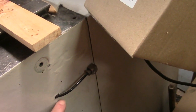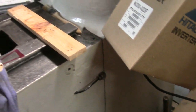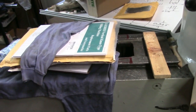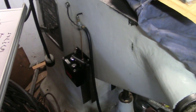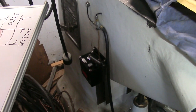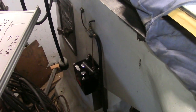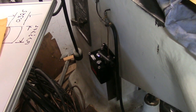I have about a couple meters of this tubing that I bought. It was actually broken out here, so that's been replaced and everything is working good. Minor progress on the Bridgeport, but very, very important. That one-shot oiler - the broken tubing on it was probably responsible for a lot of the work I'm having to do now. I think if this thing were oiled properly, it would not have seen the wear that it has sustained.